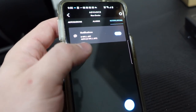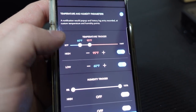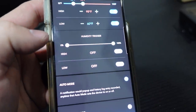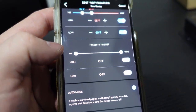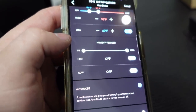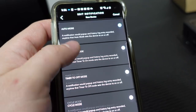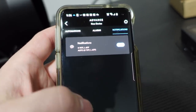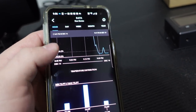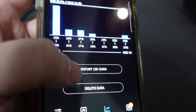Outside of alarms, you can also get push notifications on your cell phone. I've set notifications for the same thresholds: above 95 degrees or below 60 degrees, notify me. You can do the same with humidity — I'm piping in air from outside so I can't easily control humidity, so I've turned humidity triggers off. You also get history and logs in the app, and you can even export data as a CSV, which is really cool.